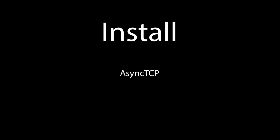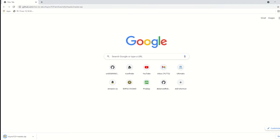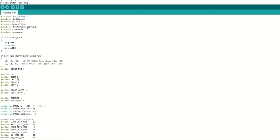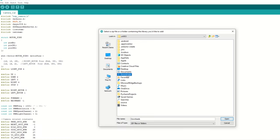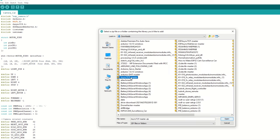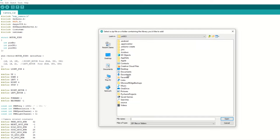After that, we need to install the AsyncTCP and AsyncWebServer libraries. Download these libraries from the links provided in the description below. Once downloaded, go to Sketch, Include Library and then click on Add Zip File. Select the downloaded zip library file and click add. Similarly, add the AsyncWebServer library as well.